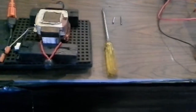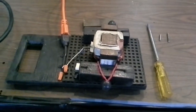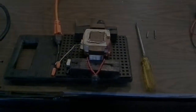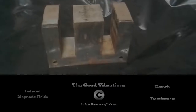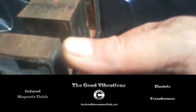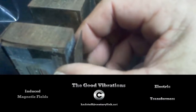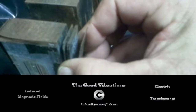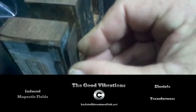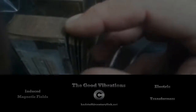But first, I'll show you some of how they run, or how this one works to get the juice to go from the primary to secondary, and what it's doing, where it's going. I'll show you that first. And this video here will show that this is just laminated plates of steel. You can't use a solid block of steel to make a transformer work. It has to have these laminated little plates that have like a glue between them, holding them together. And that gives a space between each one of these plates. Like I said, it won't work with a solid block of steel.